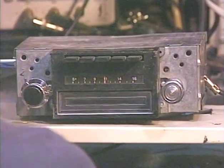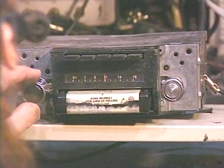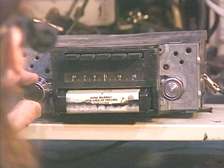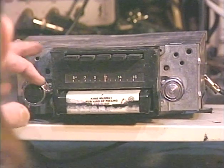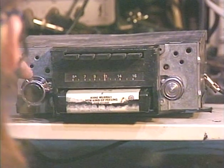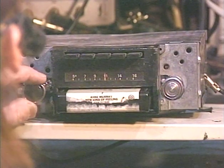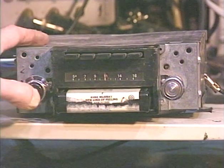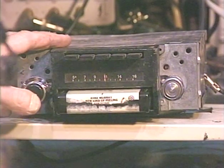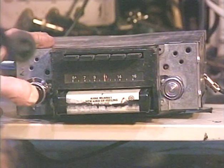Let's go ahead and do the final test. We've got some Ann Murray on a little 8-track tape. The first thing you should notice is that it sounds a lot brighter than any other 8-track — that's because of my own special design tapehead preamp. On some tapes, newer tapes, it may be a little too bright, so just back off your tone control. And now it sounds more like a regular 8-track tape. Bring our treble back up. Okay, we're going to switch tracks. Now we're going to pull our tape out. The radio comes back on immediately after pulling the tape out.